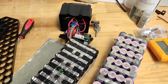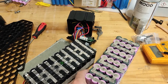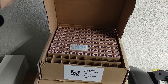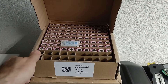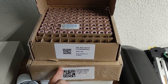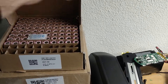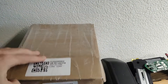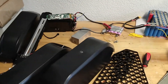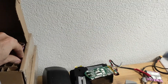So what should you do? First of all, I would order some quality cells like Samsung. These are the 18650 batteries, and this is the 21700 — a much bigger battery. In my opinion, if you want to build a high density battery system, I would go with the 18650s because they are small and you can fit many more in the case.